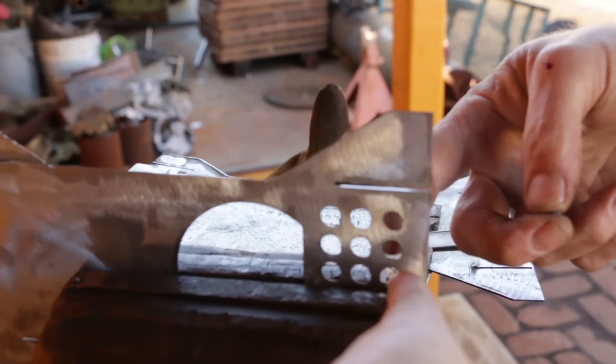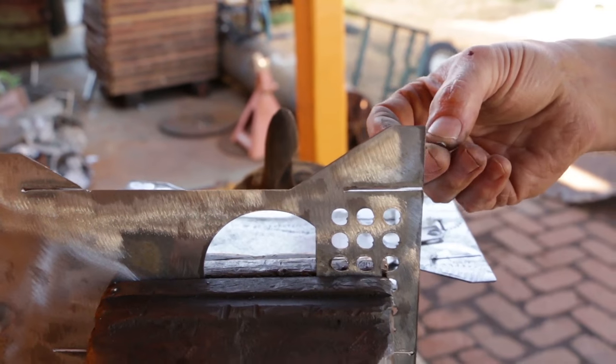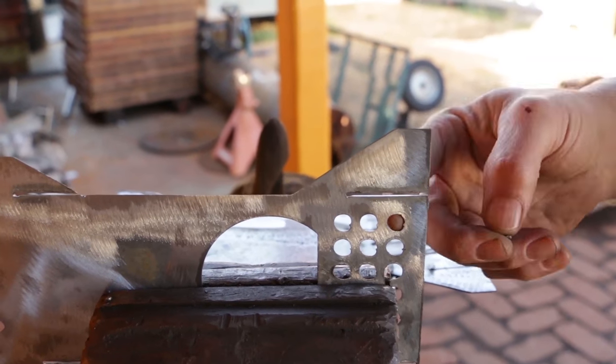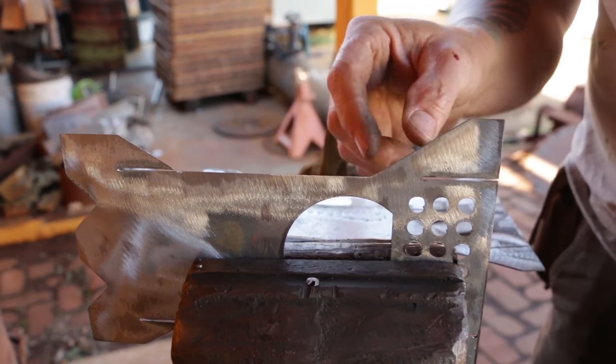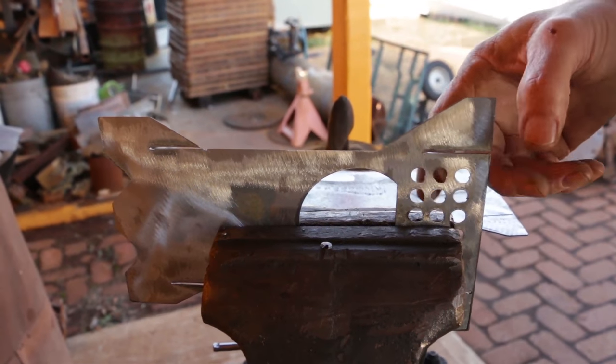Also, we told it was a quarter inch kerf, and it's not. So it thinks it's cutting where it's actually not reaching yet. If we told it the truth, that you actually cut a 16th inch kerf when you're cutting something this thin, I think it'd be fine.